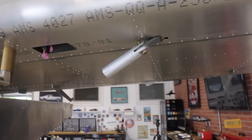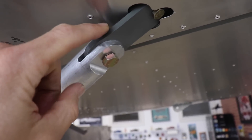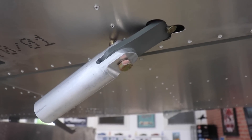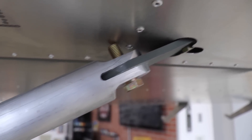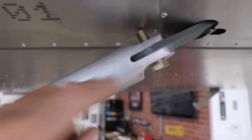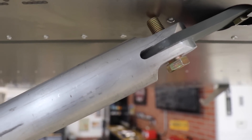The next thing I'm preparing for is setting dihedral and fitting the wing struts. I installed the upper wing attachment with the bolt through it, and I noticed the hole in this piece needs to be reamed out to the proper size — it would be easier to do before installing it in the wing. Also, this piece is rounded but this other piece has 90-degree corner edges, and the corner was interfering with the rounded part. I had to file down the edge to let it match the curve, so you might have to do that on yours too.